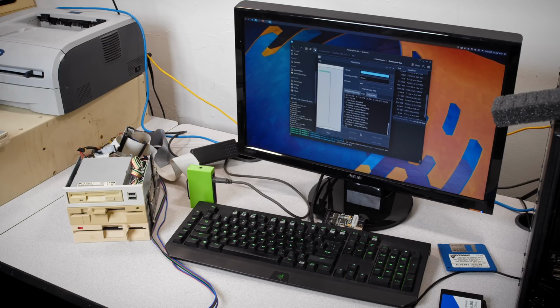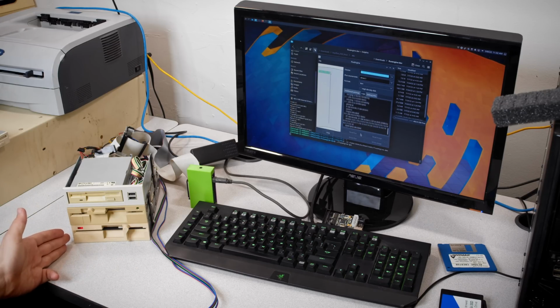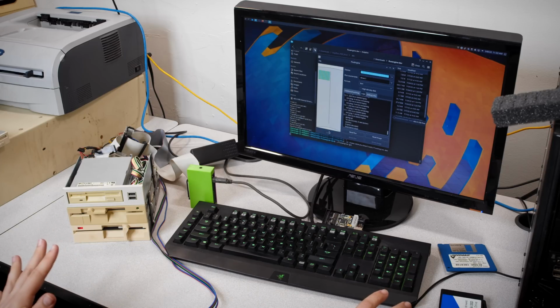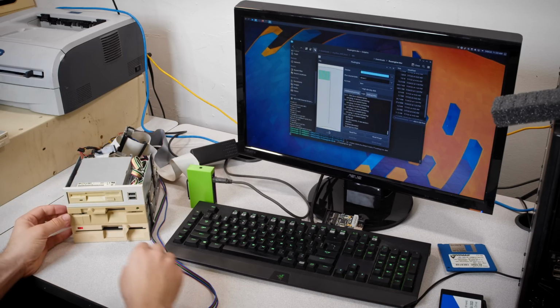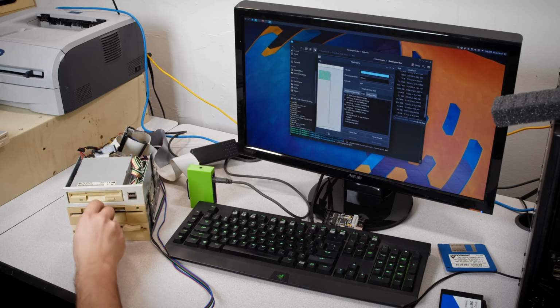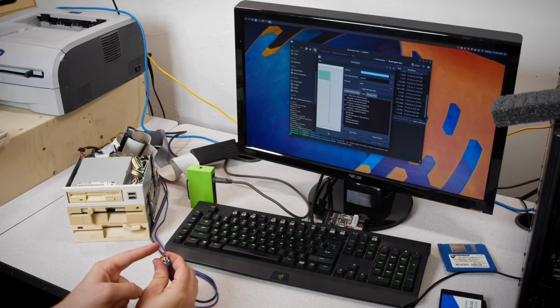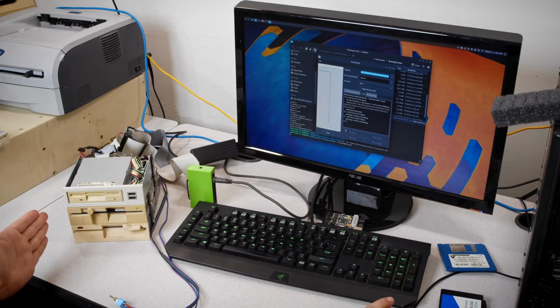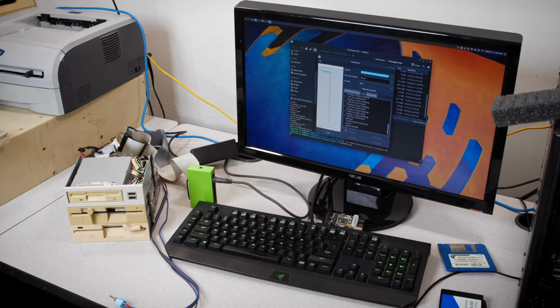We have both drives being accessed. This is single-sided disk. So that's not unexpected. A lot of TRS-80 software was single-sided. It is going to make it take a lot longer because it's retrying each side 5 times. So let's just go ahead and stop it. We verified that worked, and what we could do, take the disk, move it up to the other drive here, flip the switch, and test that it'll work in there as well. You can read on the 80 track drive. Perfect. Working great.